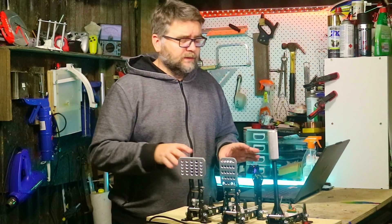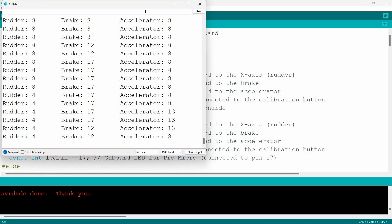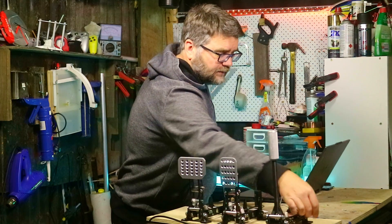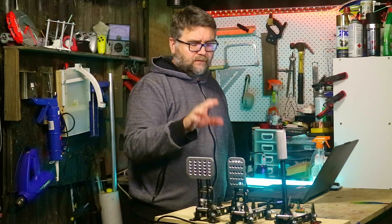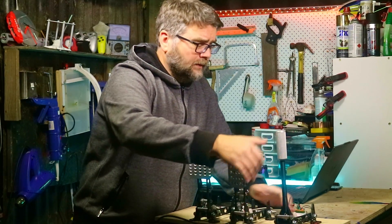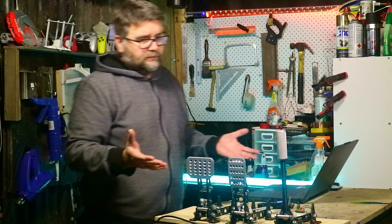It's good for troubleshooting to open the Arduino IDE, go to the serial monitor, and you can see data being output from the pedals showing what they're reading. If your pedals have already been calibrated the numbers should look reasonable, but on a fresh unit you might see wildly different numbers, which means calibration is needed. To calibrate, push the little switch — the controller starts flashing to indicate it's ready — then push each pedal all the way back and forward. Do it a couple of times if you want. Once done, push the button again and the calibration is saved.